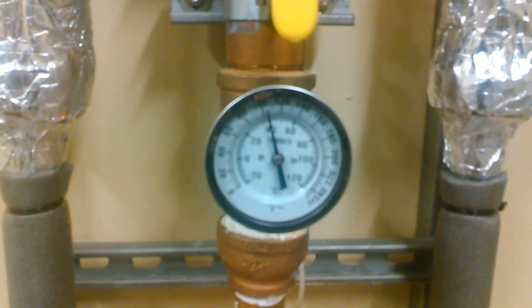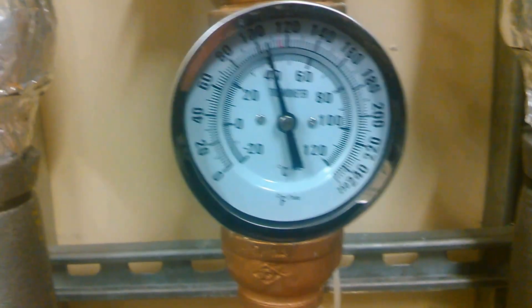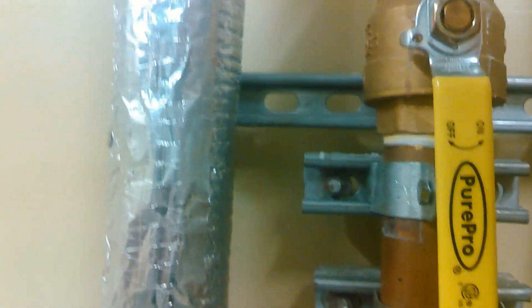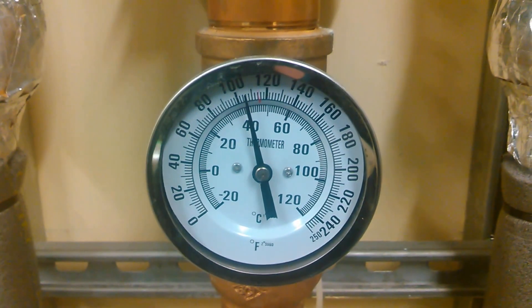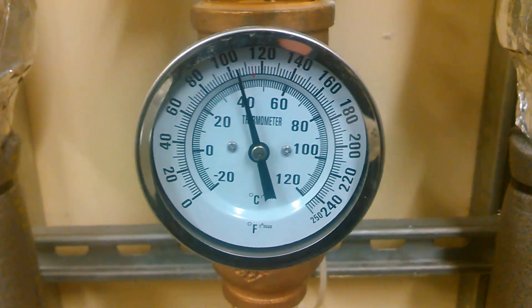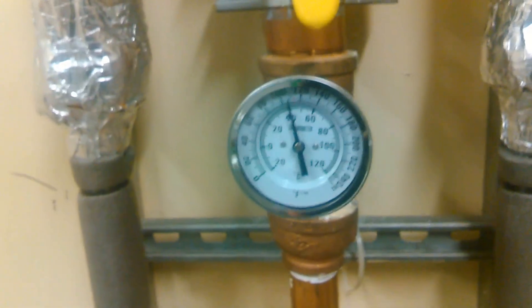Basically how this system works: we've got these huge tanks holding the hot water. It comes over here — I guess this is more energy efficient. Your hot water from the tanks comes in here, cold comes in here, it's mixed together and goes up at a set temperature. Ours we try to keep as close to 115°F as we can. By our policy we're not allowed to go over 115, and by the city's policy not allowed to go over 120. Our state regulation is 120°F for residential water.